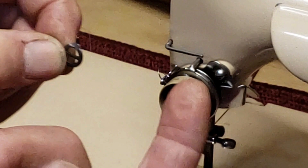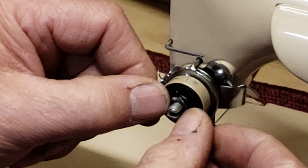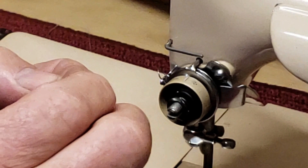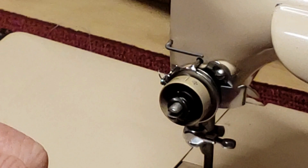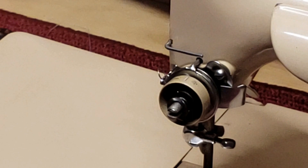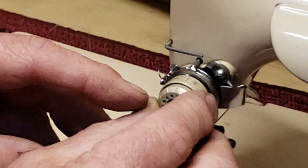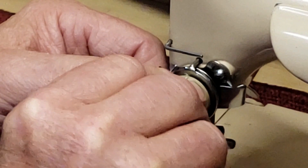And your numbered dial — I usually put it on with the zero facing up. You want the little stop inside of your number dial to be just to the right of the finger on your stop washer, so that your dial can turn and stop at zero, turn from one to nine, and then as you turn back, it'll stop at zero.